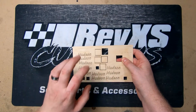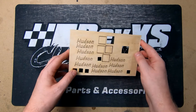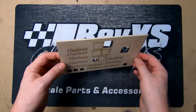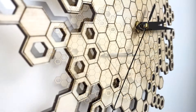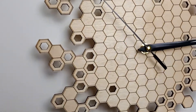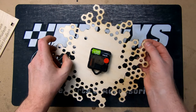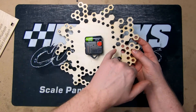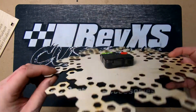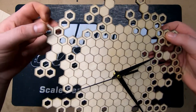For our engraving, we played around a lot and finalized on 30 millimeters a second, still at 100% power. I know a lot of people run about half power for engraving, but we found the best result on this wood was at 100%. Then we moved on to get our clock made, and this is how it's turned out — come out nice. Same settings from our test piece, and it's cut through pretty clean. This is the back side — there's a little bit of burn marks here because we used tape to hold down all the little pieces.